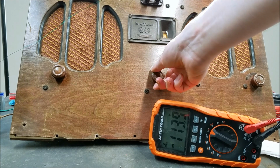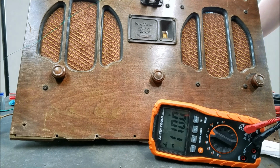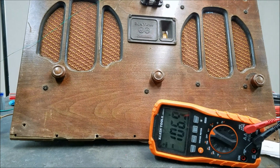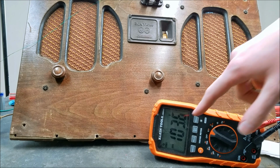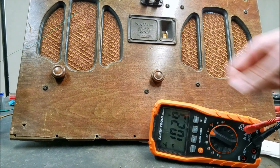Let's do an experiment. See if we disconnect. So that's disconnecting the center tap of the special battery. So when you do that, I think that relieves the forced tube bias. The tube bias can float a little bit more at once, and when you do that, it allows the bias to float to a little bit more appropriate region for this low B+, so that's why some of this distortion goes away. And you're still dropping pretty good there, now we're down at 103.